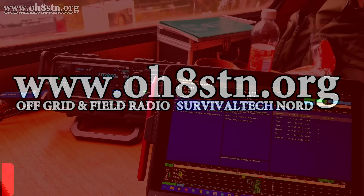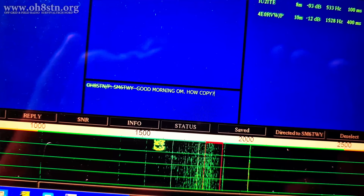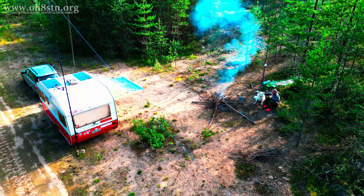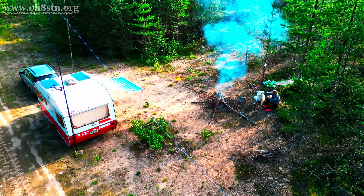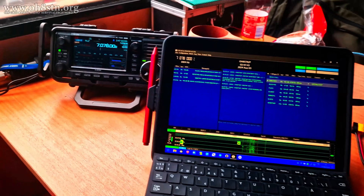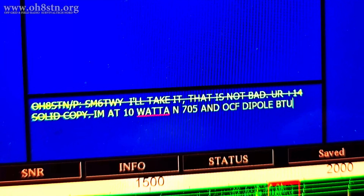One of the most important tools we have in off-grid communications and ham radio is JS8 Call. Sadly, most of the people I hear talking about JS8 Call don't understand its potential for the portable ham radio operator. Using JS8 Call, a field radio operator can utilize a very narrow bandwidth data stream to initiate a reliable QSO with a station multiple hops away. In practice, this means slow but very efficient communications versus current-hungry radios using very wide bandwidth and an unnecessary amount of power.